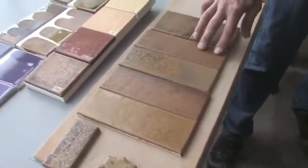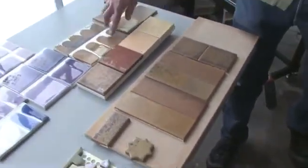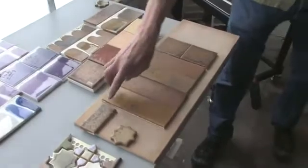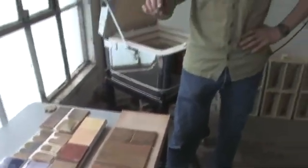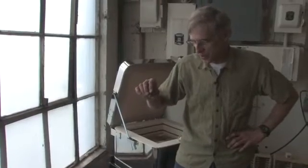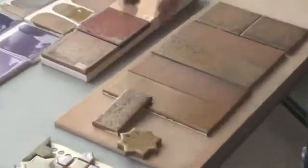Just the slightest difference in temperature or different speed of the cooling can affect the glaze so much. And this is all the same glaze. After trying some chemical changes — adjusting the glaze with different amounts of zinc and titanium — we discovered that we can use the original formula and get back to where we want it to be. It took a little testing, but using the Glaze Tech kiln I discovered that the right program for this glaze, at least this batch, was a cooling rate from the top end at 150 degrees an hour down to 1,650 degrees with a half-hour soak after that. So the same bucket of glaze can be made to come out correctly with the right cooling rate.